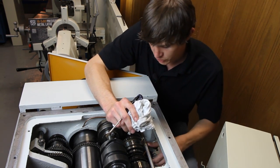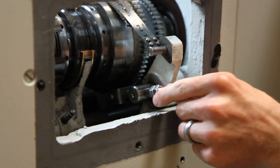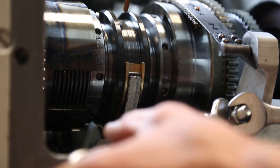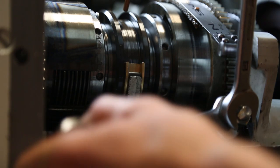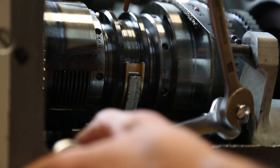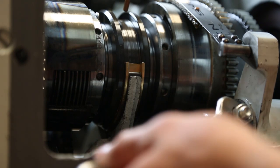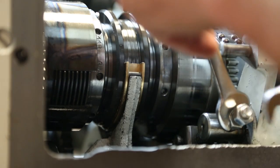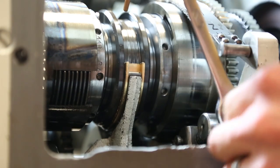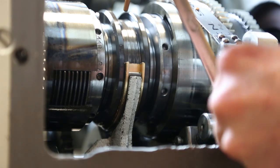Now on this particular machine, since you're in here, you can also adjust the brake. The brake is adjusted by these two lock nuts here that back into each other. The way you adjust it is just back the outside one off while holding the back one. Get it loose, and then just tighten the inside nut in about a half a turn. Typically, a half a turn will get you about one second off of your braking time.